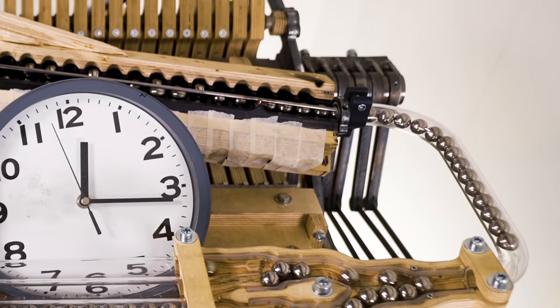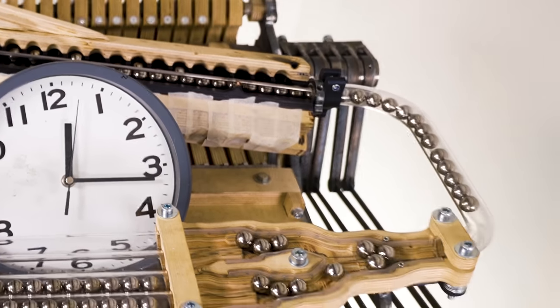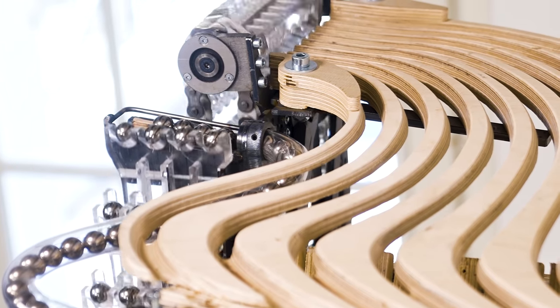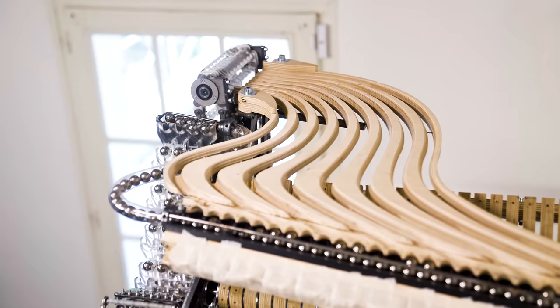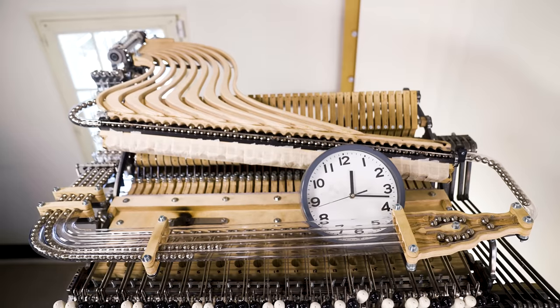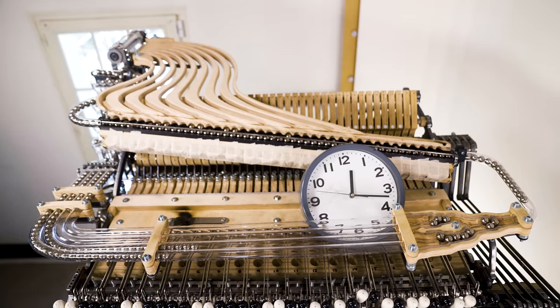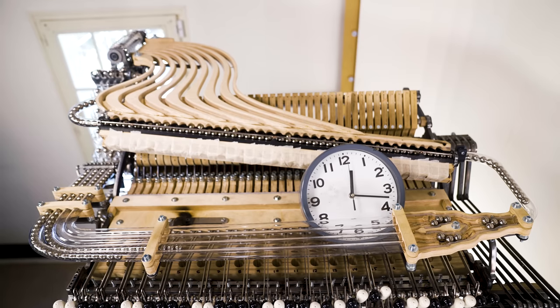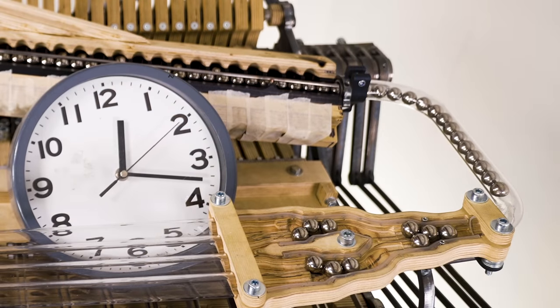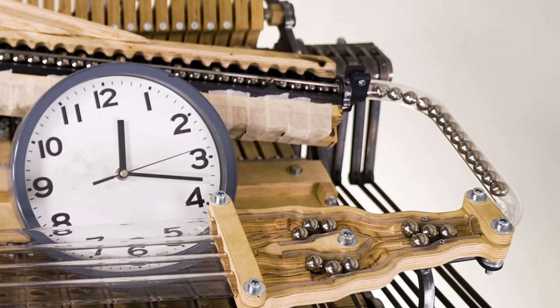And here something is happening — the marbles are stuck in the pipe. It's actually not stuck in the divider; the marbles got stuck in the pipe. This is bad. The fish stair can't offload the marbles and this is a critical failure that we should never have. You can hear the machine pouring marbles onto the floor and I'm running there to shut the machine off. I'm getting bombarded by marbles when turning the electric motor off — it's hurting not only my pride and my heart, but also my head. So it took less than 17 minutes for the machine to fail. Notably, the fail wasn't in the divider — it was in the angle of the pipe. The marbles ran too slow and we have this catastrophic fish stair fail with horrible floor marbles.